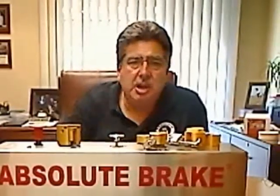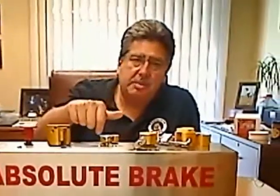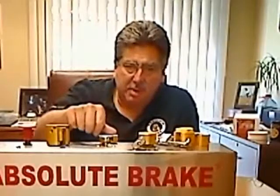So we include a jam nut and a carry bag on this particular design that goes with this valve. The installation is basically: take the cap off, put the jam nut on, bring it all the way down so it fits nice and secure like this, fits under there nicely. Then you take a 7/16 wrench, torque it a little bit, snug it, and you're done. Swivel on, swivel off, perfect.